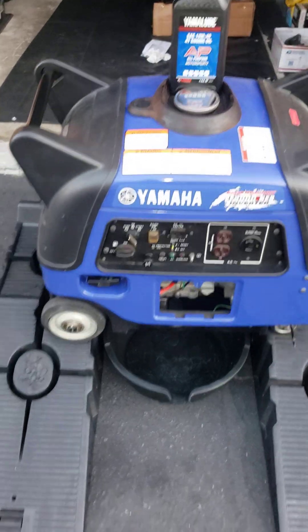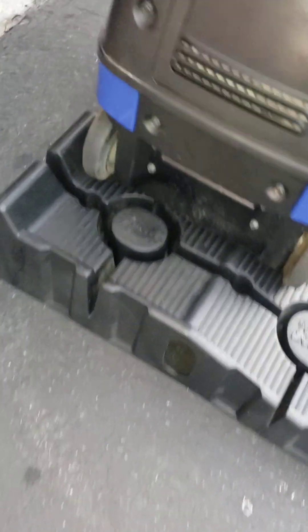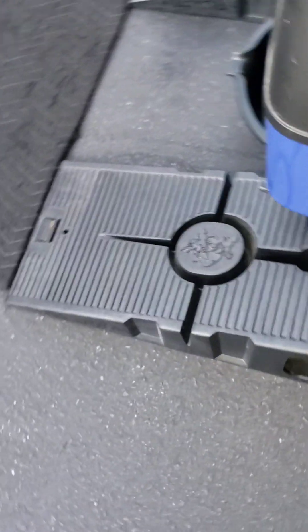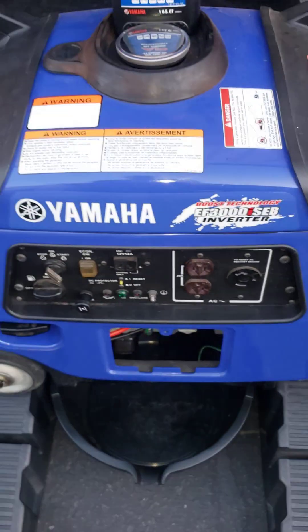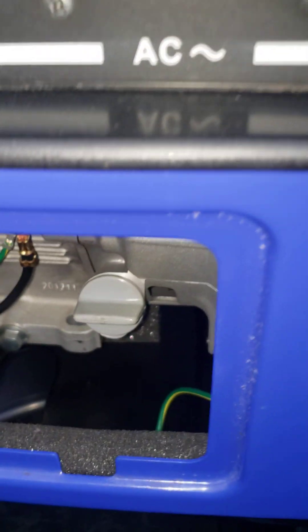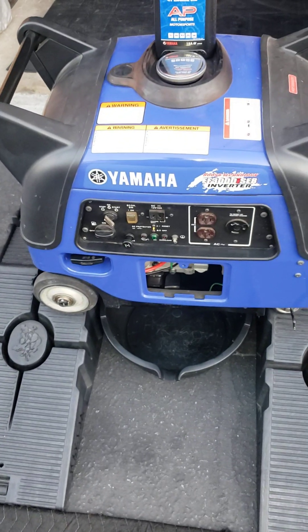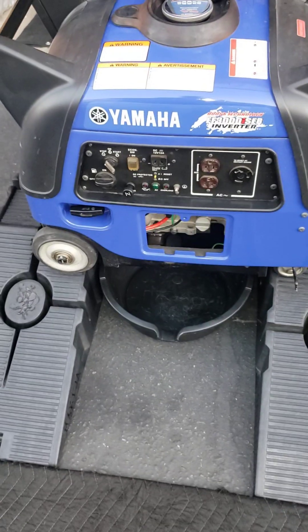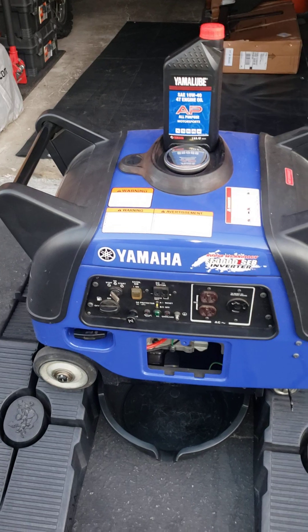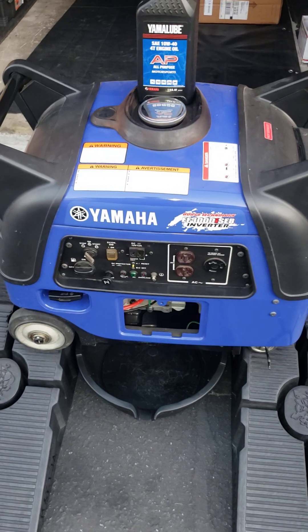The purpose of this video is to help people who own a Yamaha generator like this one, or similar heavier Yamahas like the 45 or 63 series. It's a simple solution for an oil change: use two ramps, set the generator on them leaving enough room for the pan underneath. If you're on level ground you can take the filler plug out, but I won't here so I don't make a mess. From this point, you know what to do — drain plug, filler plug. Hopefully this video is educational, saves you time and money from paying someone else to do it. It's easy, and you'll know it's done right. Thank you for watching, and I'll see you next time I work on another quality piece of equipment like this Yamaha or a Honda.